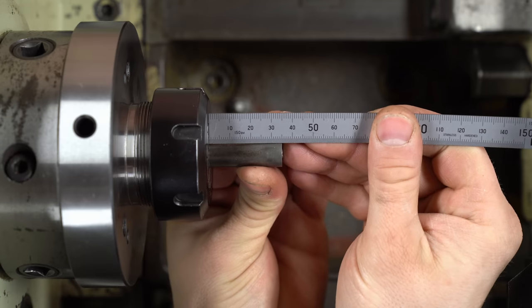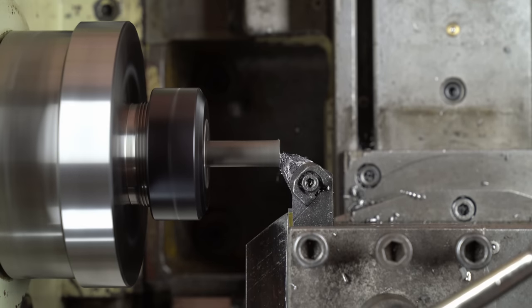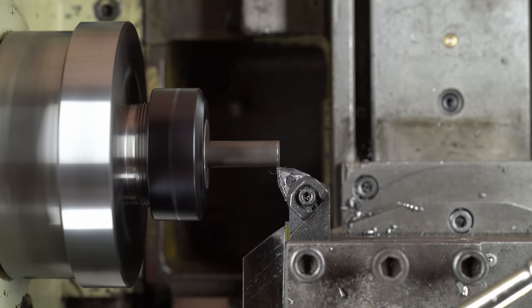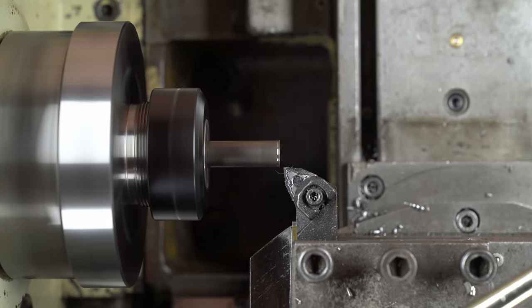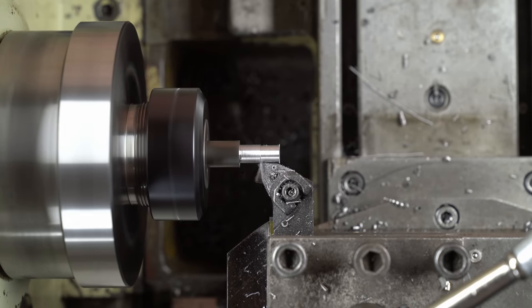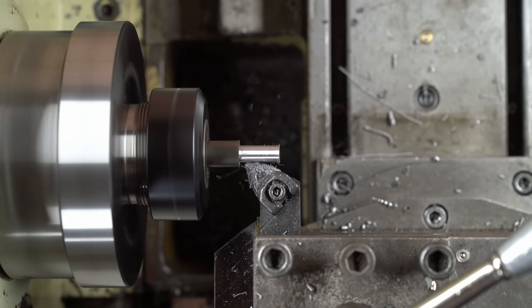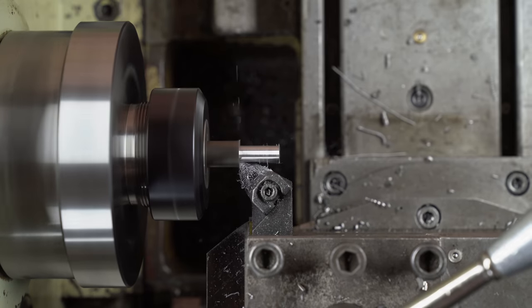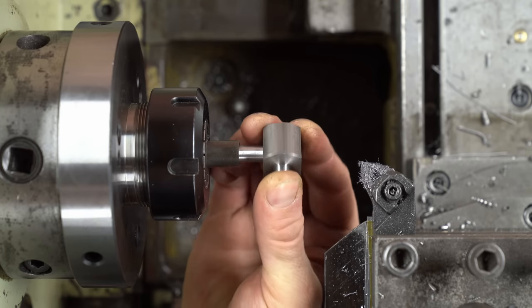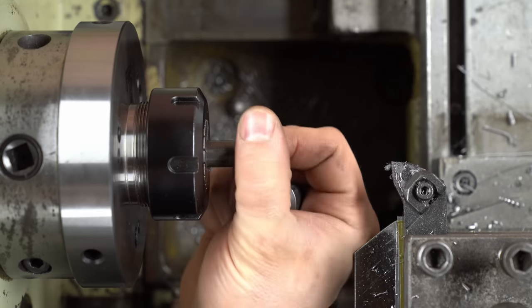There's also a whole lot of 12.7mm parts — about 8 or 10 small pins which have shoulders and threads on both ends. The shoulder is made in the same way, touching off on the length. Out of frame I've got a dial indicator set to zero, and for diameters I'm using my cross feed dial, zeroing it after touch-off and relying on that. That cross feed dial method is not the most accurate, so for a bunch of these I had to stone the part to size, but after a bit of refinement I got some good fits.